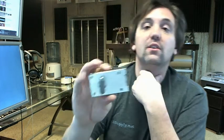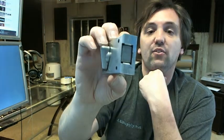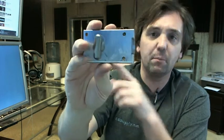If you need a cylinder, by all means, feel free to reach out to us. Kaba Ilco has many rim cylinders for this. Like a part number would be a 7015. And then after that, the value of the part number would indicate the keyway. Like a typical Schlage would be a 7015 SC8, as in Sam Charlie, then the number 8, and then the color is after that. If you need any help picking any of that out, please feel free to reach out to us.